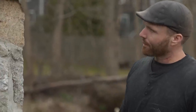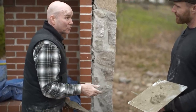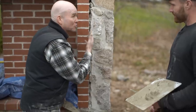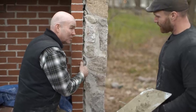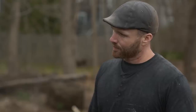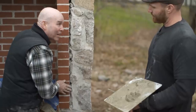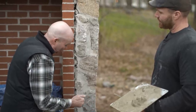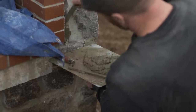Mark, how are we going to handle this joint? So this is one of the reasons I gave you all those different joiners and margin trowels. Wider joint — it varies all the way up. You can see the pockets in there — we can't leave those empty. So start at the bottom, pack that solid. That way you'll have a base to build off of. And as you go higher and higher on this joint, take one of those smaller trowels and just start punching that mortar as deep as it'll go — flush out with the stone.